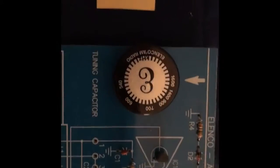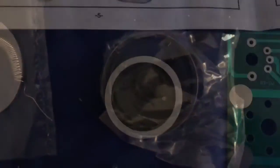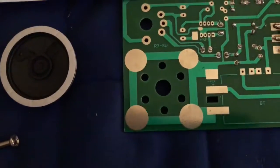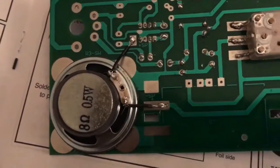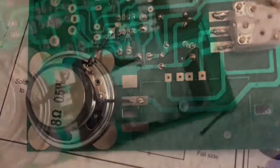Go ahead and grab your sticker; take it and put it on the dot on the dial. Remember to keep that gray piece of paper — you're going to need that later. Affix the sponge adhesive to the speaker. Remember you want the speaker to go right in between these four holes right there. Apply the wires; it should look like this when you finish, soldered on both sides — the side to the speaker and the side to the board.